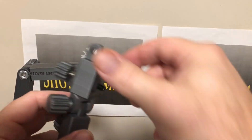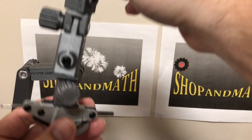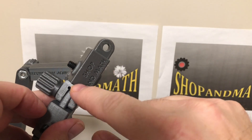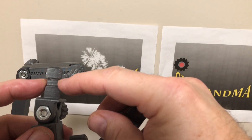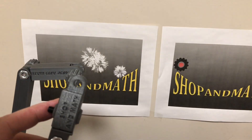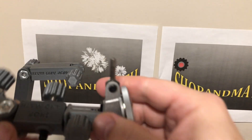So how does this work? If I were to take my locking screw off — I have my expensive indicator on there — the indicator won't come off because there is a secondary locking screw that just holds these two pieces together. You loosen this screw off and that piece comes off. It sits inside of this channel, still rotates around. Put the locking screw in and it locks everything in place.